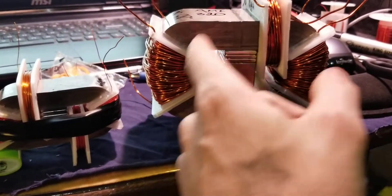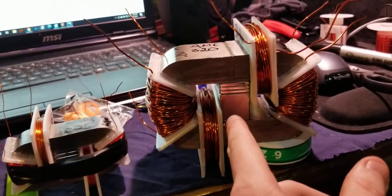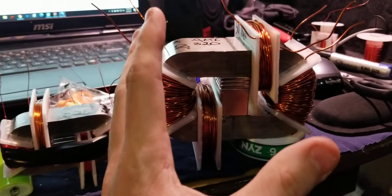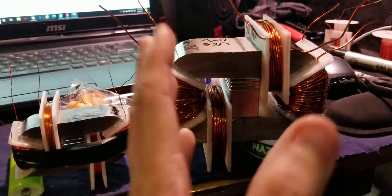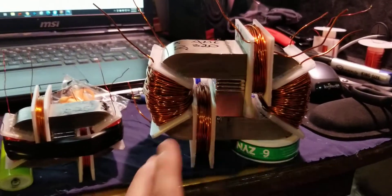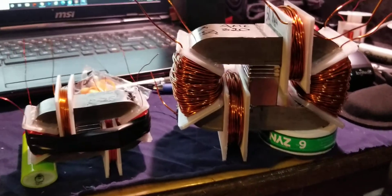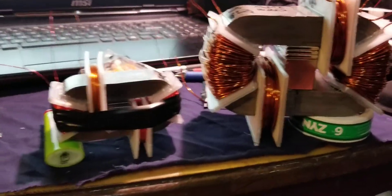All we're doing is: there's a magnet here, the flux is in there, you're pulsing — moving this field to one side and the other, pulsing it back and forth. It's similar to a shake flashlight where you shake it and charge the battery. Except here the magnet has a field that's already there and it always recovers. You pulse the field over, and when the pulse is done there's a lag, but the field will pop back — and that's where you collect the energy, because any change in flux gives you energy through a coil. You're collecting off the push this way in one coil, then the pop-back in another, and the input coils also act as output coils. It gets a little complicated in the circuitry, but if you study this long enough you can figure out a way to do it. Alright, that's it for today — peace.